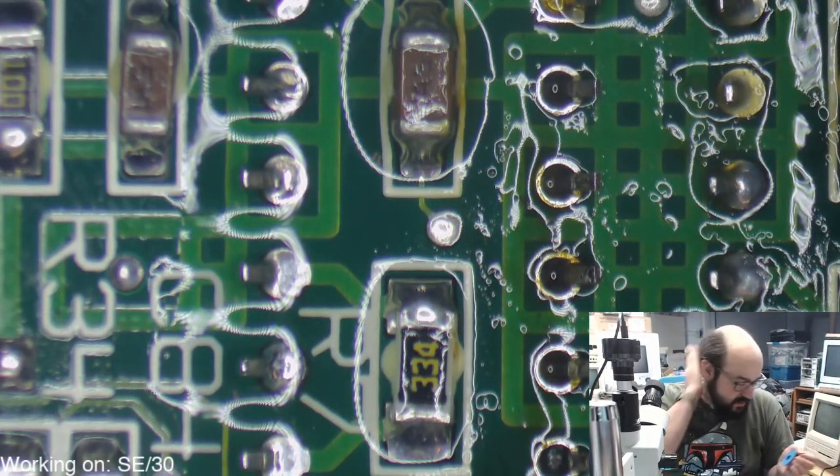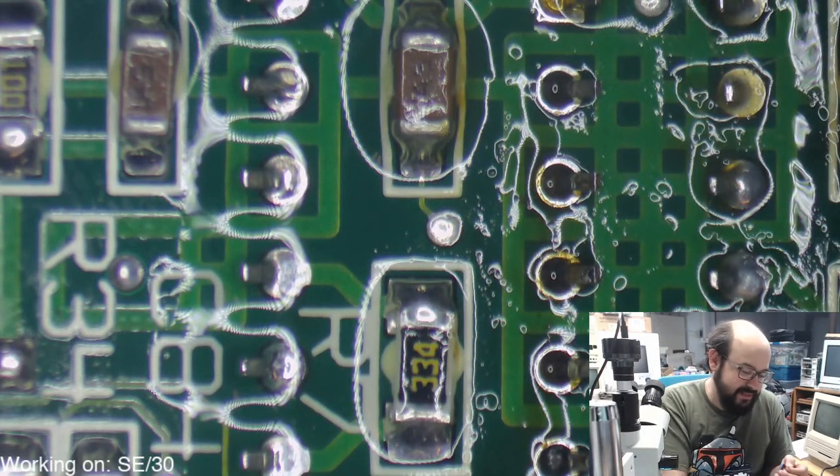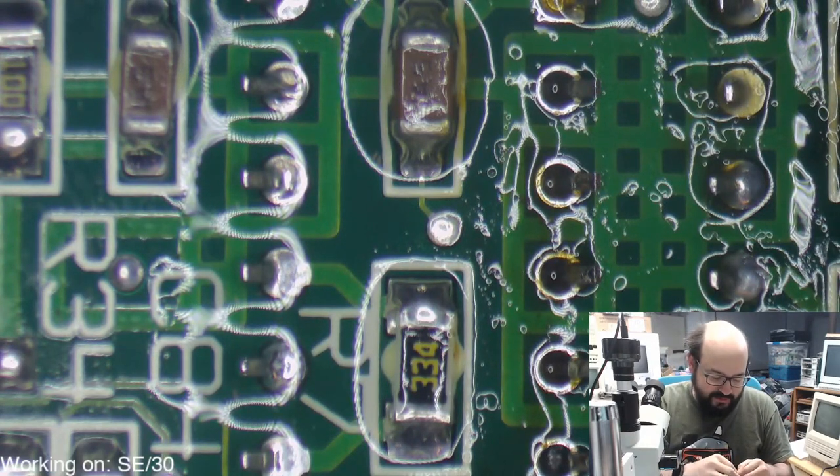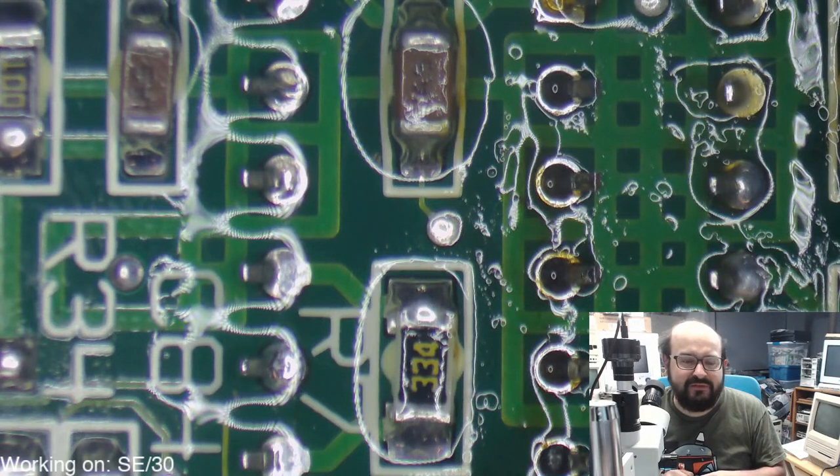I had Tiger on my G3 mini tower. Those 8 gigabyte hard drive limits are annoying, but you just make a partition of 8 gigs, and you're usually okay. It boots, but no power to any of the drives. It might be a bad capacitor somewhere. That's all I could think of, really. Something with the power supply.